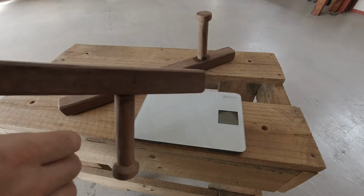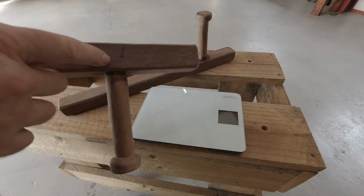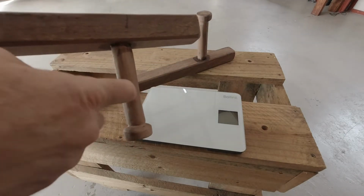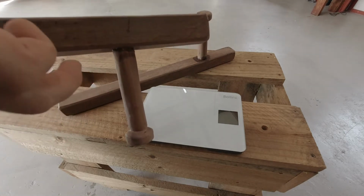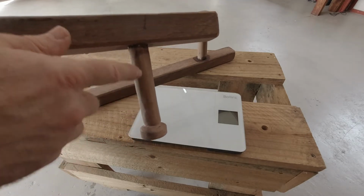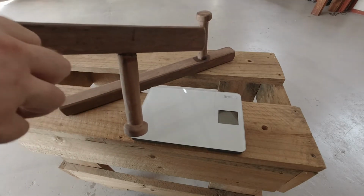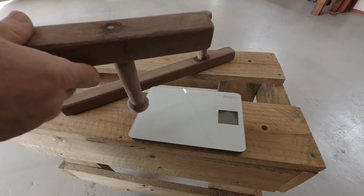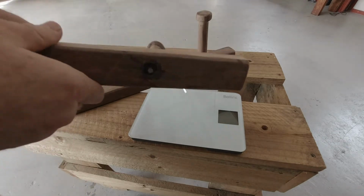Another problem I encountered while building them was that my drill bit wasn't long enough to drill an adequately sized pilot hole into the wood of the handles. So the wood screws I was going to be using are a little bit too long and sort of overshot that pilot hole. At the point where they overshot, there was a danger of the handles splitting due to the pressure through the center of this round section. So I had to just stop screwing and cut them off.